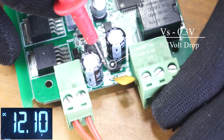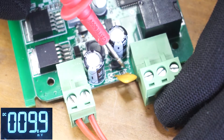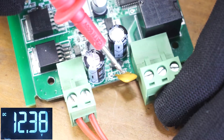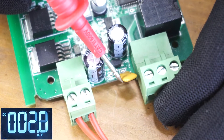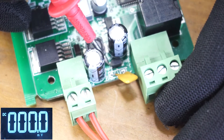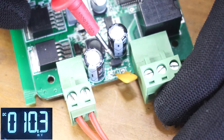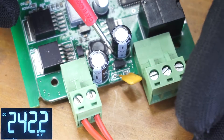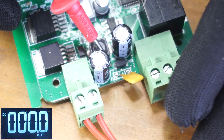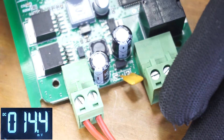After the diode it should be around 0.7 volts less than the supply voltage. If there is no voltage at the second pin of the PDC, you have a bad PDC and need to replace it. If there is no voltage after the diode, that means you have a bad diode — replace it, but make sure there is no short circuit beyond this point before replacing the diode.